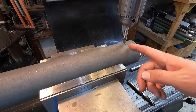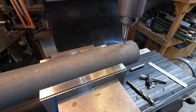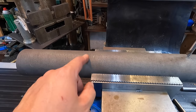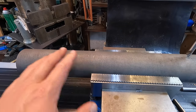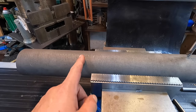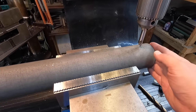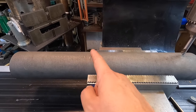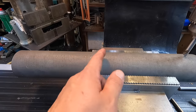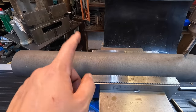We'll have a hole here that's going to hold the foot all the way up inside the pipe whenever it's not being used. And then what we're going to do is step down, and we're going to drill a hole. So perfectly level and everything, I've got it written down, is 15 1/4 from the base. So I've got to add 1/4 inch, because I've got a plate I'm going to weld on the end. So 15 1/4 to the hole, and then I'll just step to each side of that, maybe about every 1/2 inch or so, and we'll just have a series of holes. Actually, I think it's going to be right in this area here that we will do that.